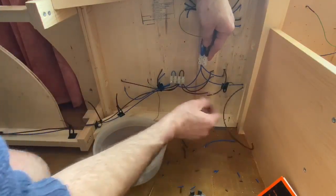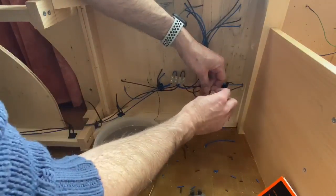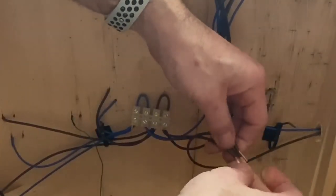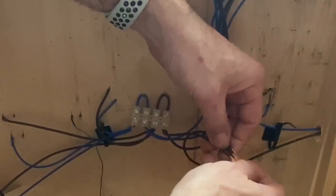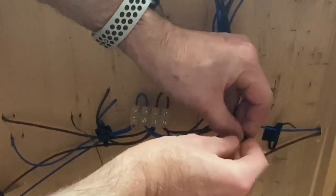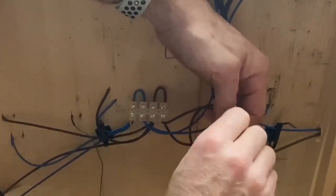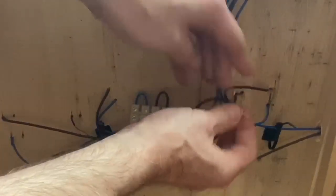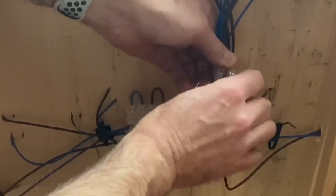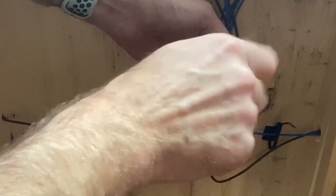I'll show you how I go about doing it. I take the wires and cut the tail slightly longer — just over a centimeter — because if they're much shorter you won't be able to twist them. I get all the ends of the sheathing together so they're about level, then twist the whole lot together. That goes into the terminal block, trying to get the sheathing into the hole as well so there's no bare metal exposed, then tighten it up.